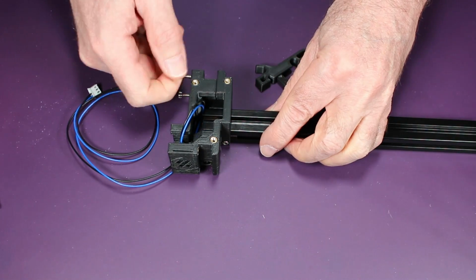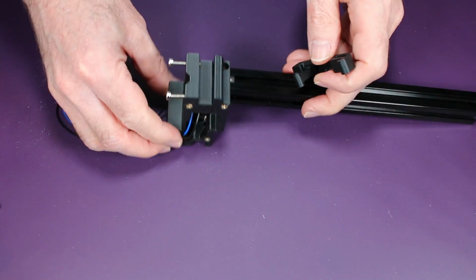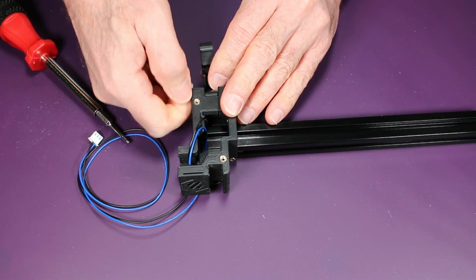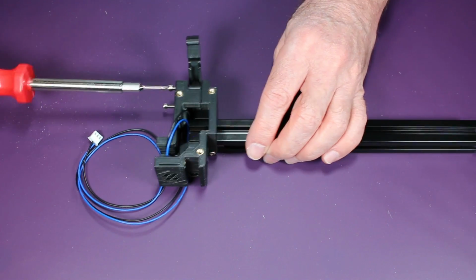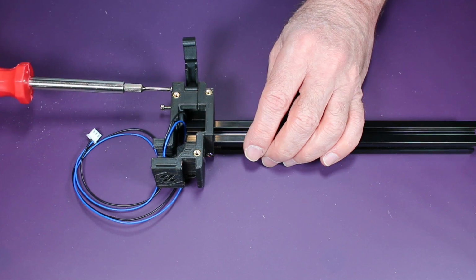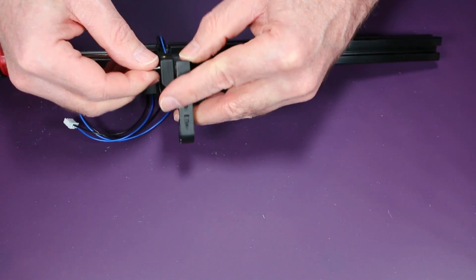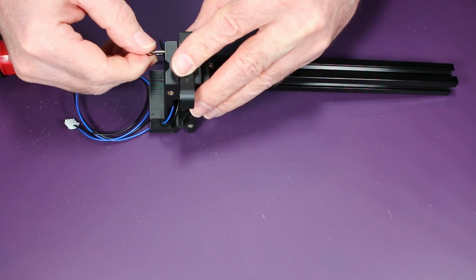Not sure why, but I got confused which way is up a few times. Be sure to check the manual closely here so you don't make the same mistake I did. The screw should go through the actual hole on the hinge, like so. And then once that's in place, on the back side of the latch, it does not actually go through the latch at all. You simply have to screw it in, and the back side of the latch has a hook that's supposed to hook onto that bolt once it's completely screwed in.